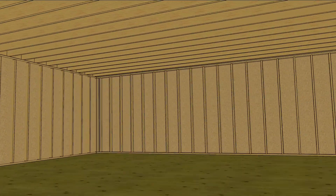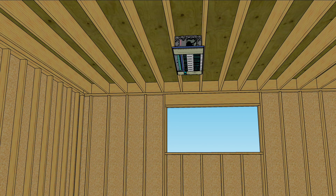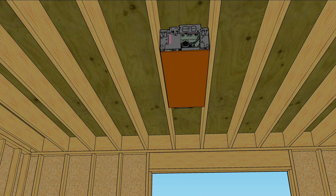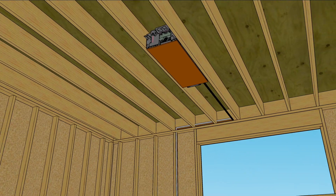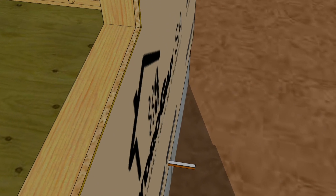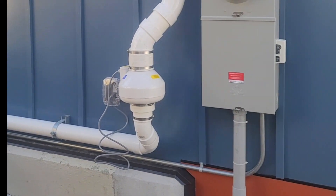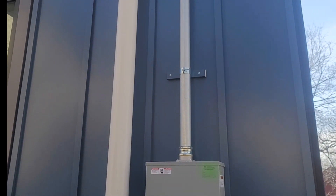Downstairs, the Mitsubishi units are great for remodeling because they slip between 16-inch on-center framing, which happens to be how this house was built. The cover plate is left off until the drywall goes up, so the guts of the unit are protected with a temporary cover. Refrigerant and condensate lines from inside the unit can snake through the framing of the ceilings, walls, and floors on their way to the outside compressor unit where excess warm or cool air is dumped. As long as we're out here looking at mechanical stuff, let's look at the white PVC pipe running up the side of the house — that's a radon mitigation system sucking soil gases from under the basement slab up, out, and away.